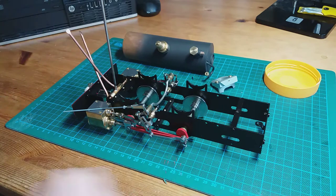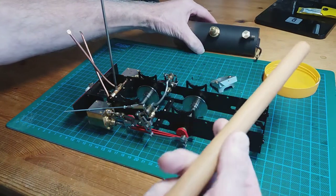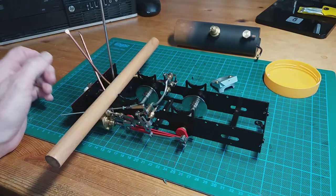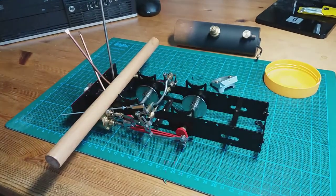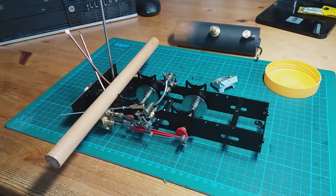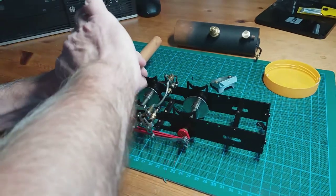What I've thought of doing is using this wooden dowel, placing it on the chassis as a support as I bend the pipe round. Once it's bent through 90 degrees, it should be roughly two centimetres above the chassis frame. Let's have a go at bending it and hope I don't damage the pipe during the bending — here we go.